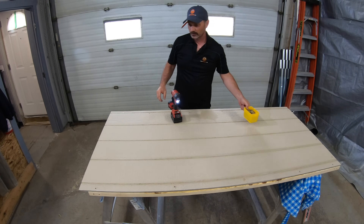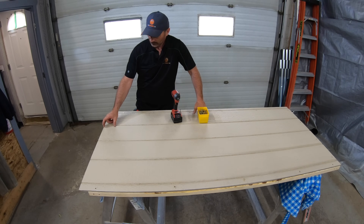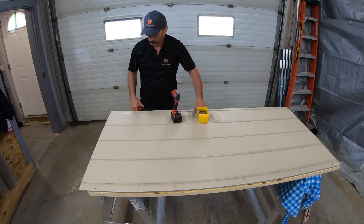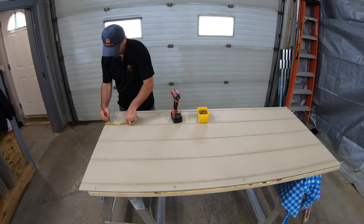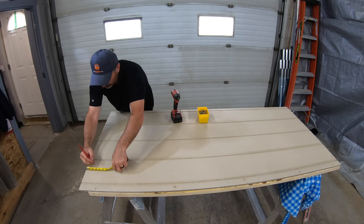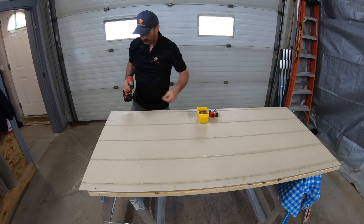I just realized I've only got 3-inch trim, so I've got this 2x4 up 2 inches from the bottom. I don't have a lot to screw to there, so I'm going to mark these ones just to make sure they get covered with the trim. I put those screws in too high and they would have been exposed.